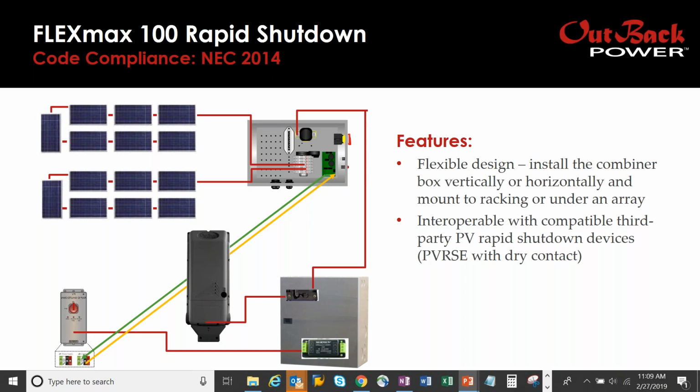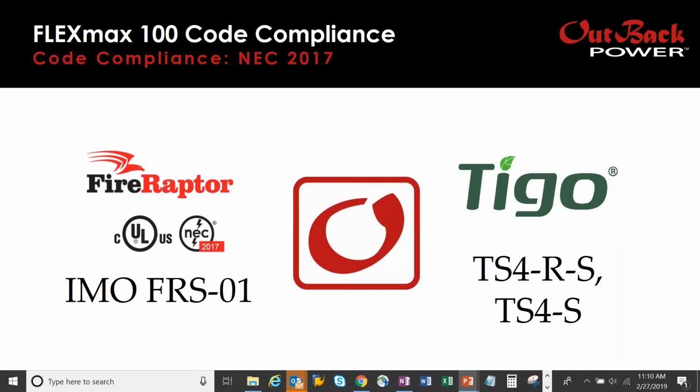So the diagram here depicts a system with the new RSD-AFCI. It's a flexible design. The combiner box can be mounted vertically or horizontally, and it's interoperable with third-party PV rapid shutdown devices through a dry contact option to the FM100's auxiliary ports. So we'll take a look at that on these slides moving forward.